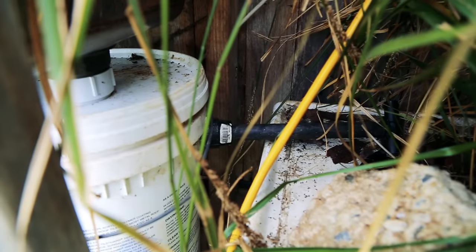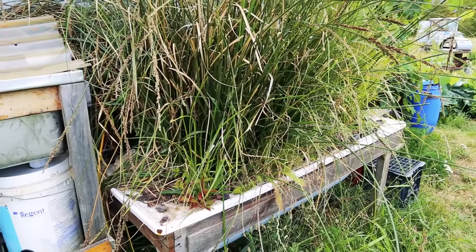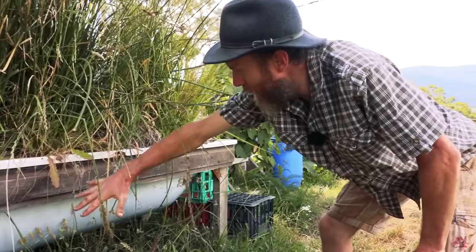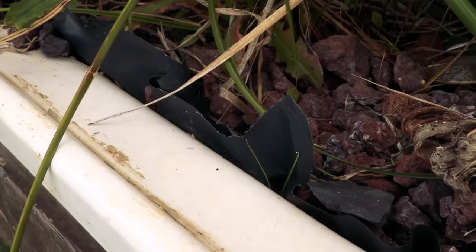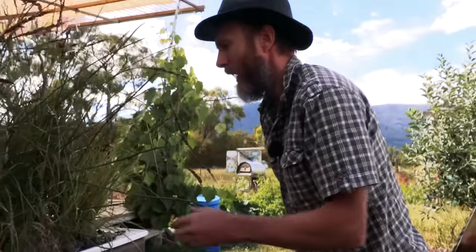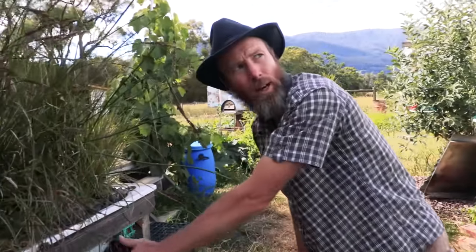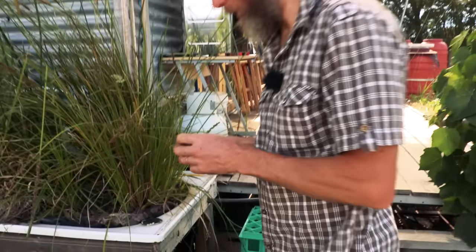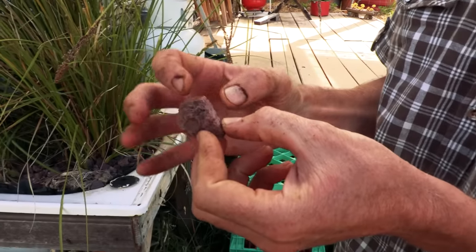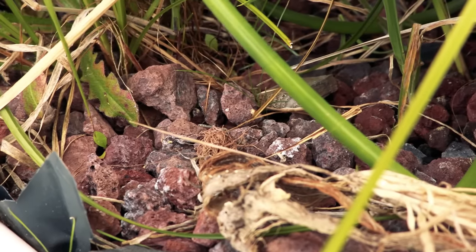After the grease trap, the outlet flows down into gravel in a bathtub. There are partitioned areas — a wooden divider covered in plastic creates three basins — so the water can't travel straight across; it has to pass through each basin and be filtered in turn. The medium is scoria, a volcanic rock, which is quite porous, providing lots of space for biology to make its home and do the real work of cleaning the water.